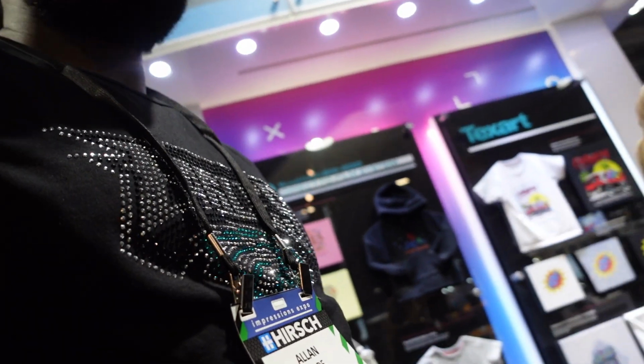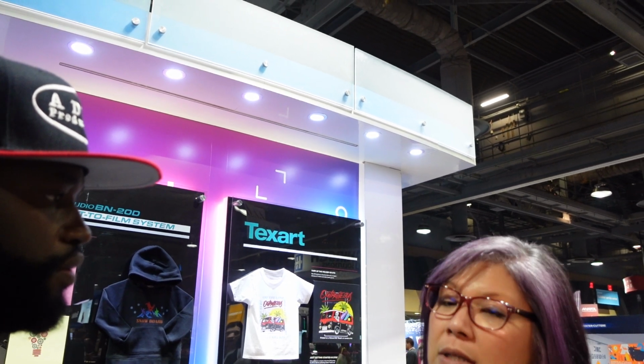Yeah. Oh, yeah. There are different ink technologies depending on what you want to print on. Right. So with UV inks, the ink sits on top of the object and a UV light cures it. So that's what makes it stay. As opposed to our eco-solvent inks, think of it as the ink biting into the material. So the vinyl banner warms up a little bit so the inks come in and kind of absorb into the substrate. Then you have your pigment inks for cotton garments and things like that. And those usually have a pre-treat, so the ink sits on top of the pre-treat. Direct to garment. Yeah. Exactly.